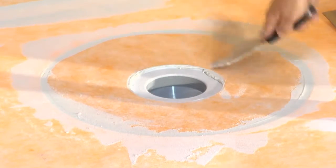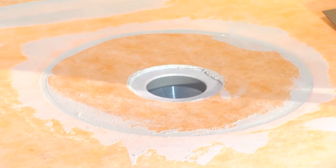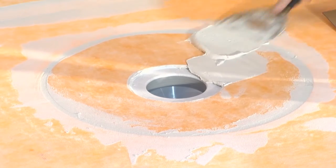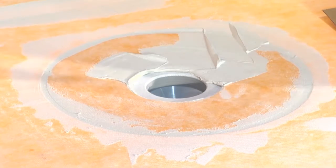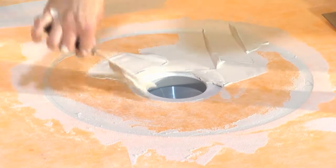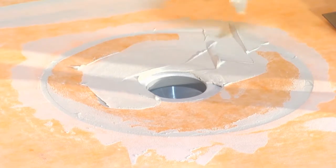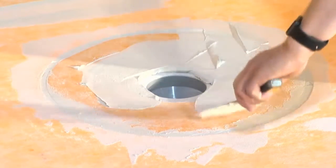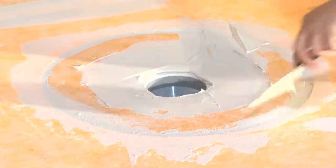And you can see that we've waterproofed everywhere else, haven't we? We've got our tray to wall connection done. We've got our tray to the face of the bench. We've got the bench deck to the back wall done. Inside corners, outside corners done. The niche is all watertight. All the penetrations where we put the fasteners have all been treated in this wet area. This thing's ready for tile.